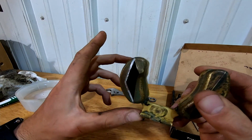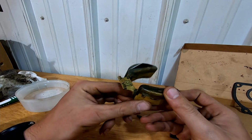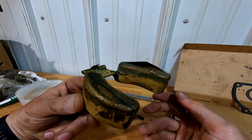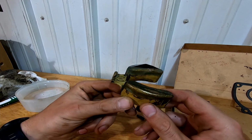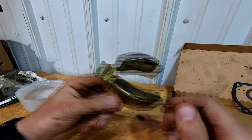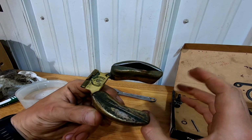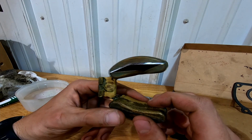Well, popcorn bag went boom. I got it too hot. I was trying to go too fast. What I was doing was, to start with, I was just warming the one corner and letting it sit and kind of fume out, and then warming the one corner, fuming, letting it cool down as it goes. Kept doing that cycle. I was honestly probably about empty. I didn't hear any more rattling, but I could get fumes every once in a while to come out. And then I just overbaked her and it went. So the hole wasn't big enough to, you know, vent all the pressure.